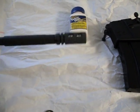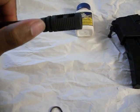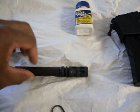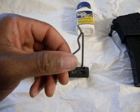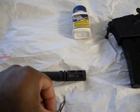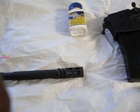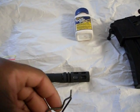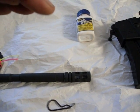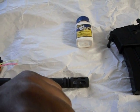I drilled just a few thousandths of an inch down into the barrel, then installed the pin. Before installing, I rounded up the end of the pin so it would go deep down into the barrel — because the drill bit has that cone or bevel shape — so I rounded it so it would go down in there flush.